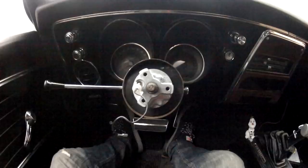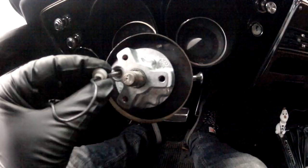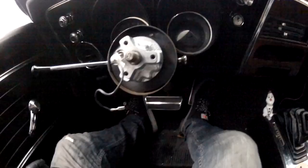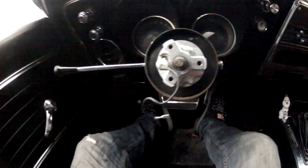We've reached a really interesting spot. Sorry about all the ambient rain noise. When we pulled this piece off, we can see there's a spring that leads into a little cylinder right there, and that cylinder is surrounded by plastic — this controls the horn. That spring stays compressed, and when this hits the ground, the horn is going to honk. So that's how the old Chevy way did it. They ran that wire out into a grounding plate, and it plugged into that right there. The steering wheel cap had a spring on it to keep it off the car. You press it down, it grounds the wire, and the horn honks. Pretty ingenious.